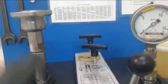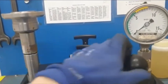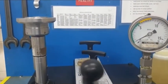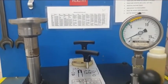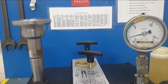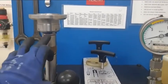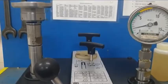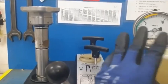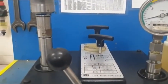Why 1.5? Because we have checked the pressure of the carrier, which is around 0.5. So it will displace a little, and you can expect 1.5 or at least nearby that. See — now it's around 1.5 and it's starting to float. That would make your reading incorrect. Actually, this is not wrong — this is correct because 1 bar plus 0.5 is 1.5. But your expectation is different; you're expecting only 1 bar.